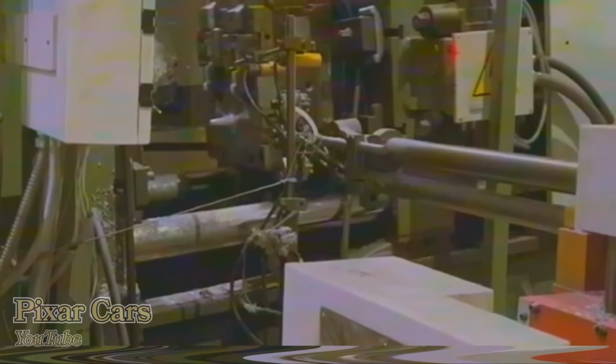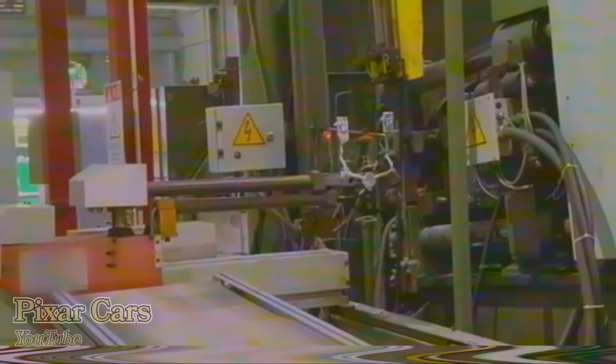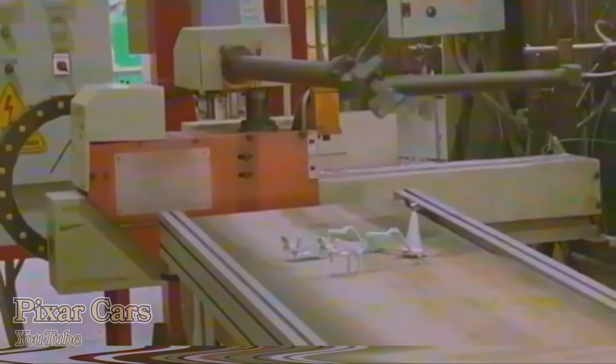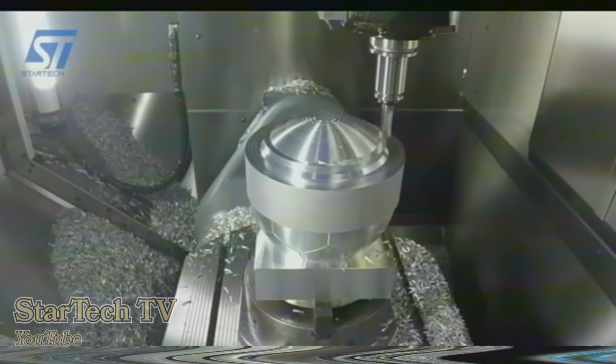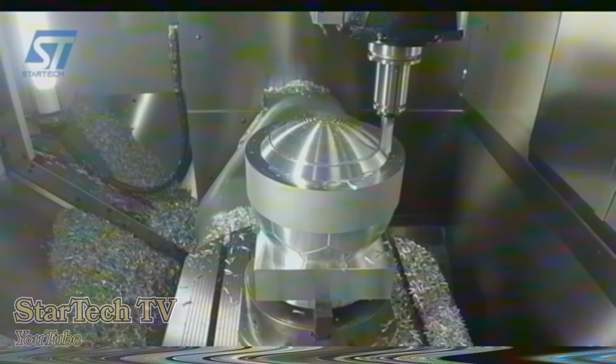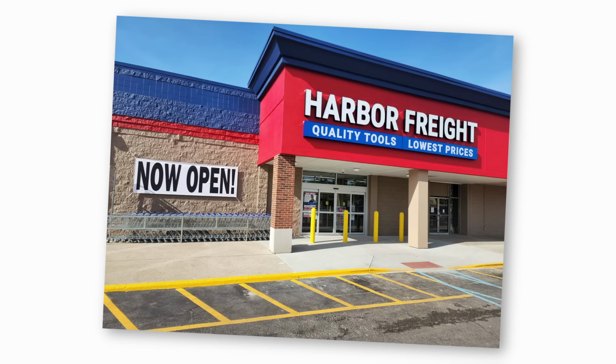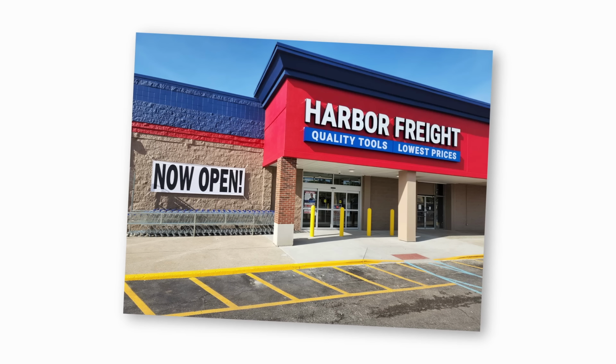It makes for a material that's incredibly easy to melt down and cast. That's great for production. While the tools and dies are uber expensive, costing tens of thousands of dollars each, once you have them, you can mass produce parts in minutes, if not seconds. Zamak is cheap, and by using dies, you don't lose as much material as, say, machining, where you carve away a bunch of metal, time, and labor. Good for precision parts for an airplane, but not so much for a dinky toy you need a bunch of. Or cheap nuts, bolts, and tools. The wrench kind, not the mold kind, sorry.